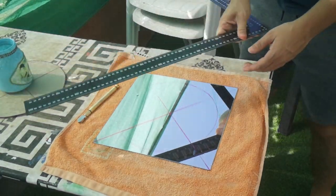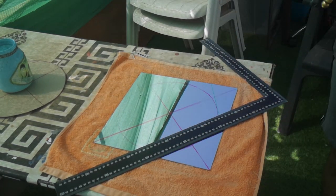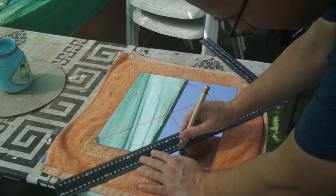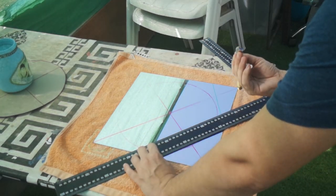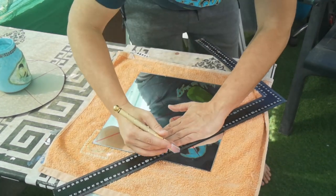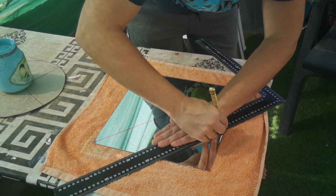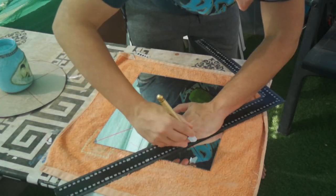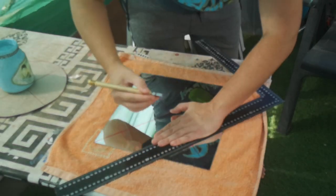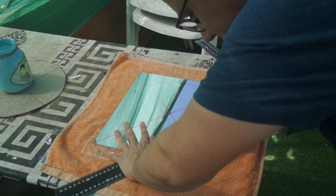I got four attempts, so this is how you shouldn't do it. I watched a YouTube video about 10 years ago and I misremembered - it was actually an acrylic cutting video. In acrylic you have to score multiple times to snap it off. You do not do that with glass. As you can see here I'm scoring very many times and from different angles, and this will only make the glass crack.